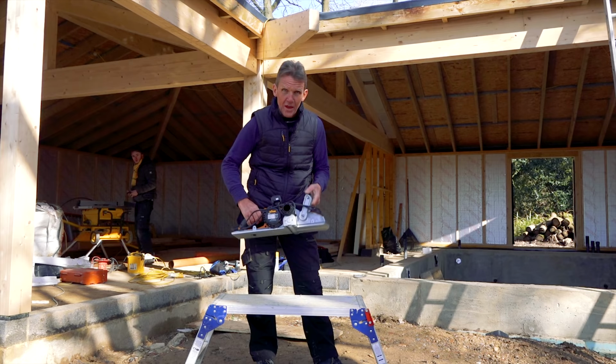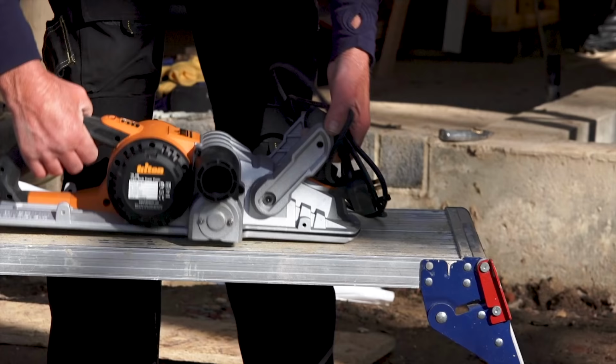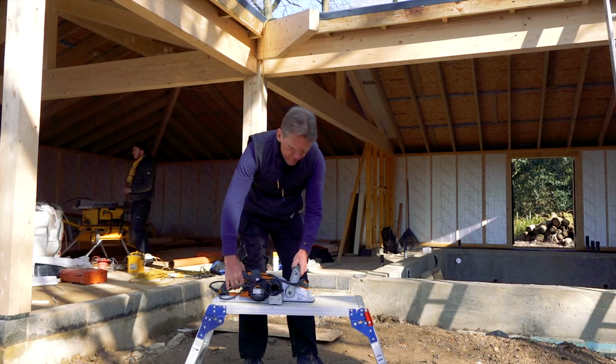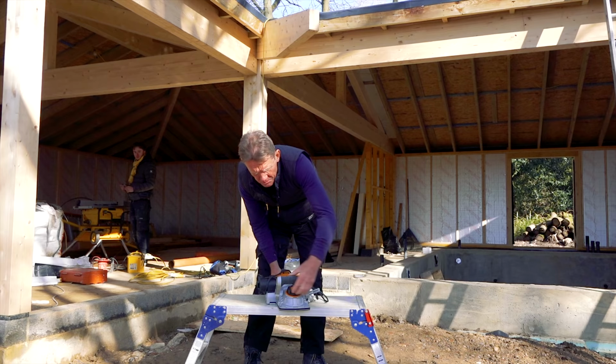You wouldn't want to shoot a door down with it, but if you're trying to plane off tabletops, benches, when you've done a glue together job or something like that, you're trying to plane off large areas, then this will do it. So it will take up to 2mm at a time with the adjustment on the front here, but actually I prefer to do it in smaller chunks, like let's take off 0.5mm at a time, adjust it down.